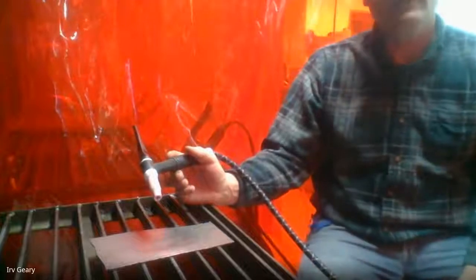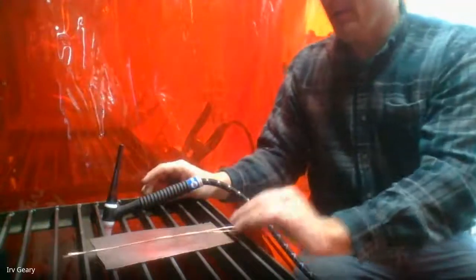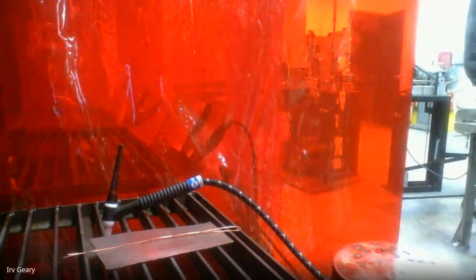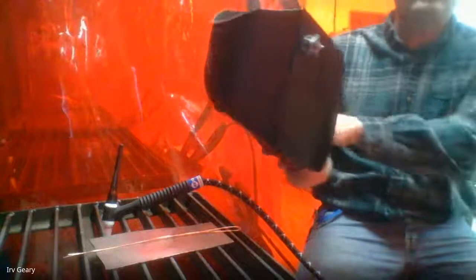It's basically just like using a gas torch except I'm controlling the heat with my foot pedal, and it's all about maintaining a puddle. TIG welding is also like MIG welding in regards to safety equipment. You need to have your number 10 lens helmet on, and if you start doing heavy TIG welds, TIG welding is actually brighter than MIG welding — you may have to turn it up to 11 or 12.